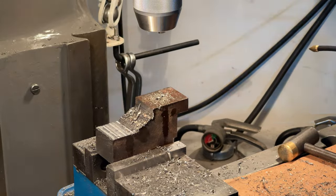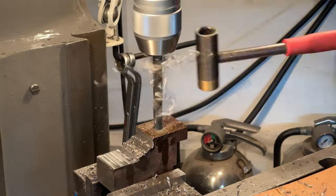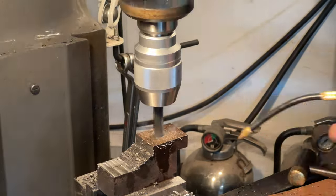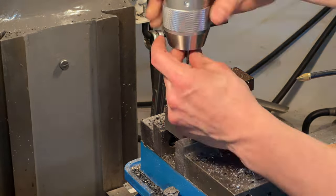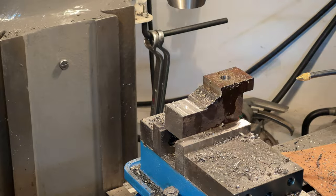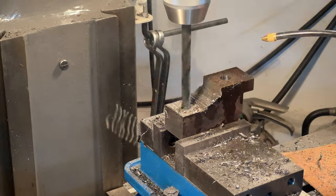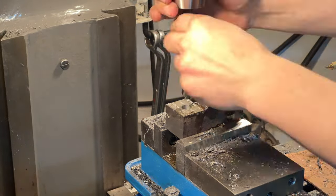When examining the part I'm copying, the machine surfaces were not really that important. The most important thing on this part were that the bolt holes were drilled in exactly the right spot. Once a test fit confirmed that the holes were in fact drilled in the right spot and the part had all the appropriate clearances to fit, I began shaping it.